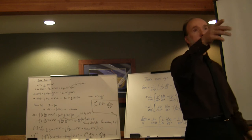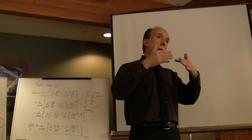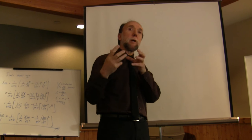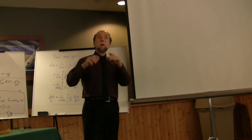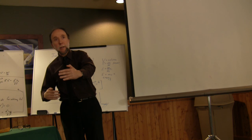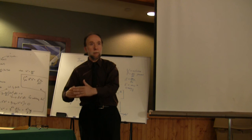Excellent. I think that one thing that I'd like to move is that we have to take heat away from the inside and the outside. Yeah, because right now it's only being taken away from the ends, which is very bad. Now, there are many things to study here which are really questionable. One of them is using the stack, it has historical reasons and so on. You don't want to have a single crystal, of course, or even two, I can show you for a number of reasons. But having 8 at 2 millimeters or 16 at 1 millimeter may be too much. We have to study how about 6, how about 4, and so on. There's a lot of things that have to be studied.